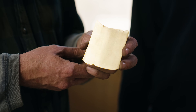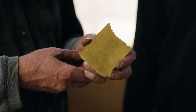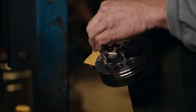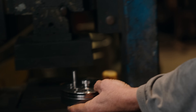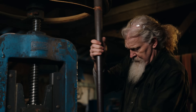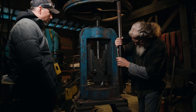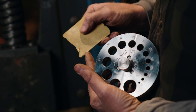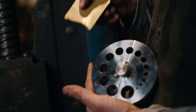One of the things we found is we still have some surface issues that give me some concern. So I know we're not going to be able to raise anything or create a form like we were hoping to. But we will be able to cut this and make some coins — we'll definitely be able to do some coining. Now that we have the gold rolled to the thickness we're looking for, we have to get it to the right size. So we go into this round plug cutter — it's going to cut this out very cleanly and allow us to go right into coining. I've just marked off a couple of the cracks that I want to stay away from and then we'll punch it out.